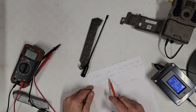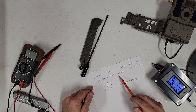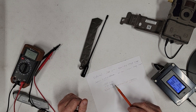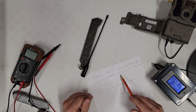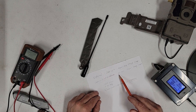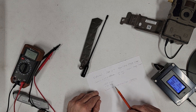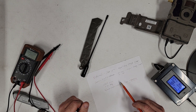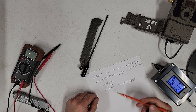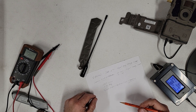Then with the camera direct-mount antenna — one of these two — it averaged anywhere from 27 to 28, but most of the time I was seeing between 29 and 36 seconds to upload. I think one time it was even 38 seconds. So being conservative, let's say it's an average of five seconds longer that the camera is in transmitting mode, pulling power from the batteries.